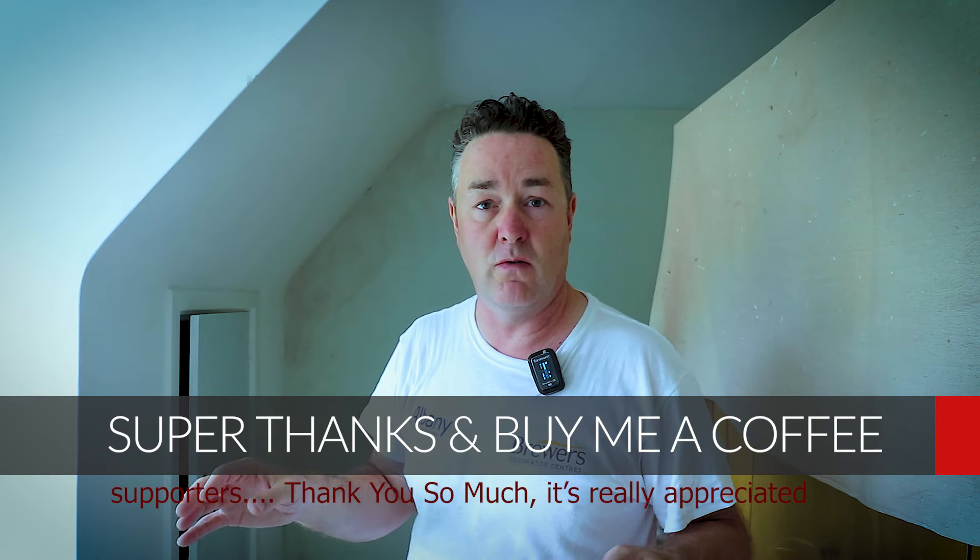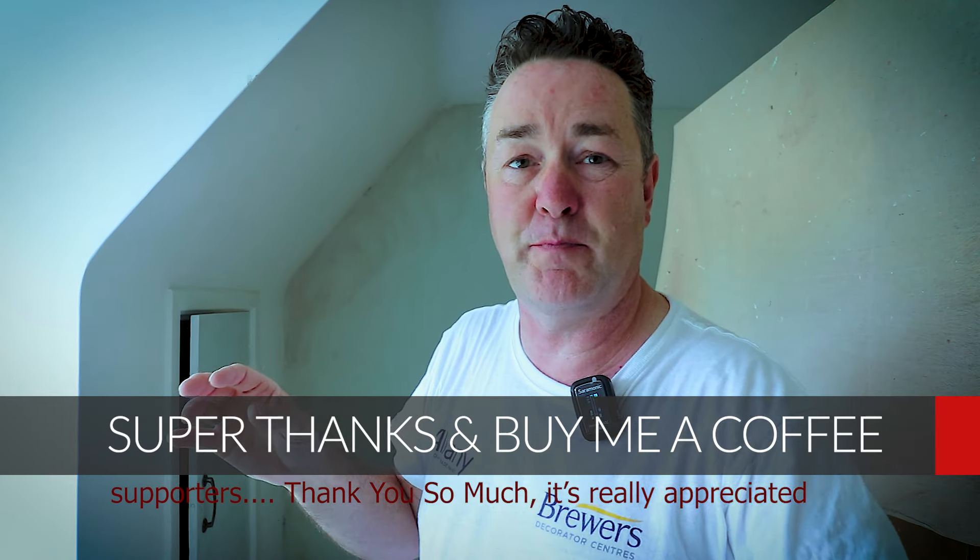I'm on this job and it's a bit of an unusual one — it's a room that's slightly in the roof. The customer has painted this room over the years themselves; I've done plenty of other rooms in this house but not this one. You can probably just see in that corner — this is what the video is about — there was mold, mainly because of condensation, humidity in the room, single brick, poor ventilation. They've got new windows now so air is circulating, but that wall was really bad with mold spores.